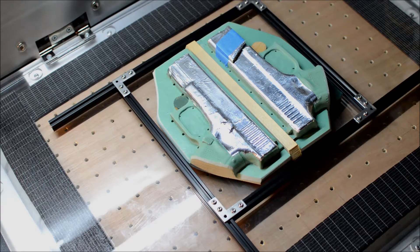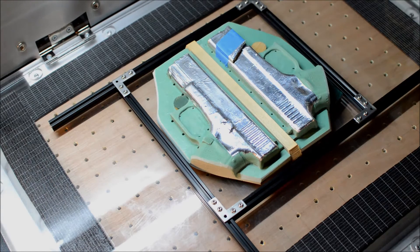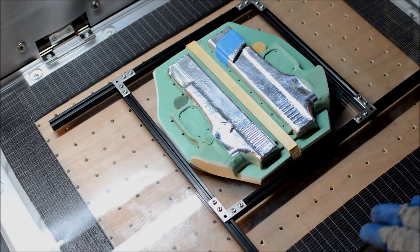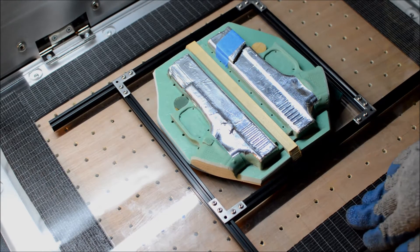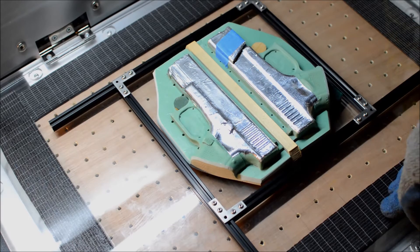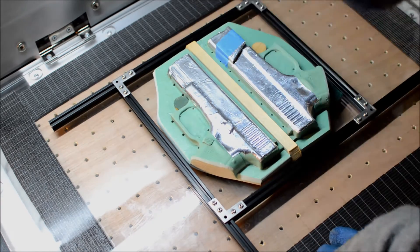What I've done is gotten a piece of Lexan that covers the entire length of the vacuum surface of the HD 200. This is the membrane top to the HD 200, which I just keep flipped up and out of the way. Once you get your Lexan cut to size, get some type of insulation or gasket material to create a gasket. I used insulation tape from the HVAC department — two layers — just to get it big enough to create a nice tight seal when pushed down.